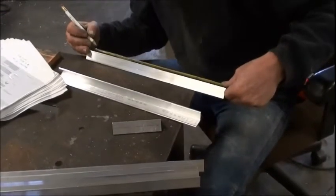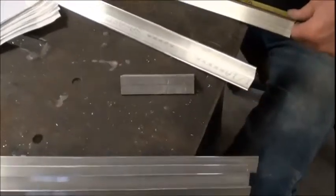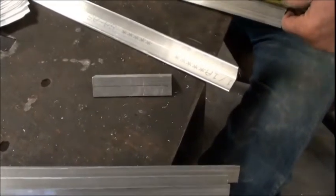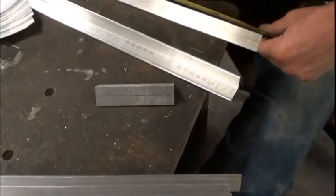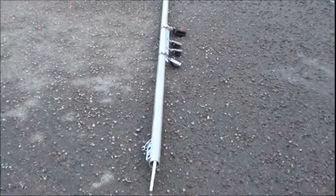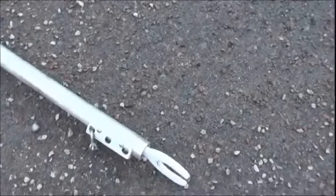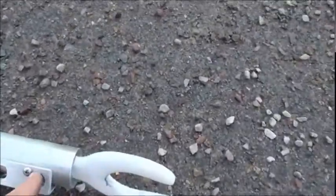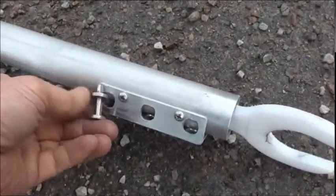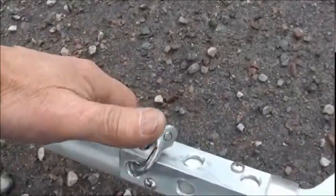Dave is marking out his block train on the boom, and this short piece is for the tack of the sail to hook to on the boom. Basically we're drilling half-inch holes in there to hook the shackles to. This is the boom completely assembled. We've got the boom jaws here in the front, screwed on with a screw that drives through there. This is the tack — you have to find a shackle that fits through it. This one I took and ground it square so it fits through the half-inch holes.